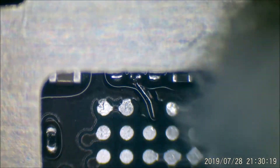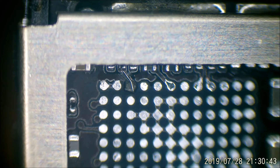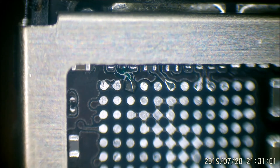I'll give it a good clean because I know a lot of techs don't bother with the conformal coating, but I'm always paranoid about risk. For the sake of a couple of seconds, just quickly put a little bit of UV mask on there to keep it in place — it's not really a massive task. While that's under the UV lamp I can quickly reball the audio chip.